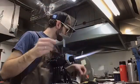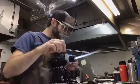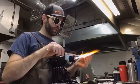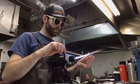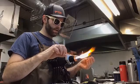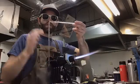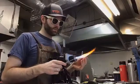All right. So, we'll do this again. We'll stick our handle on the tip so we can control it. We'll heat it up to make our bend, our 90-degree bend. Okay. Once that's solidified, we'll heat up 1 inch of material from that 90-degree bend over towards my right hand.